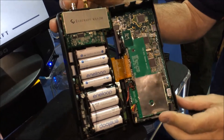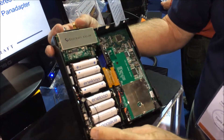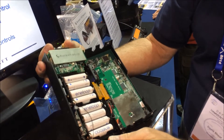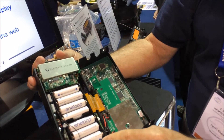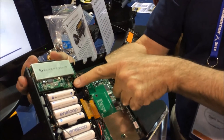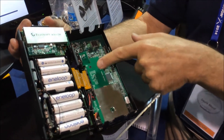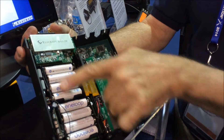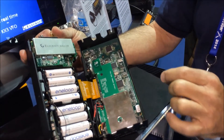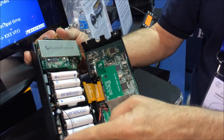While we're in here, let's go over some of the other options in the K3. Here is the roofing filter board. You'll notice it actually moves a little bit, but it's held in by the screw here on the heat center. This particular model has Sanyo interloops — those are very popular and are extra. The antenna tuner board we have sitting underneath our 2-meter module. The other option is the battery charger board, which also serves — when we close this up — to ensure that the batteries stay in place. So the options are: battery charger board, antenna tuner, the 2-meter option, and the roofing filter.